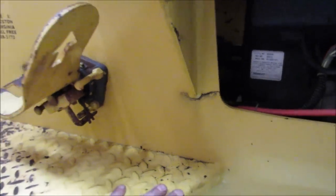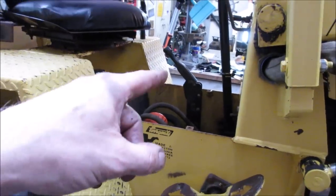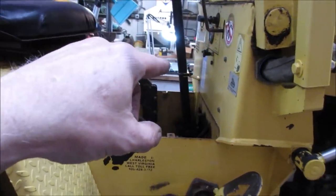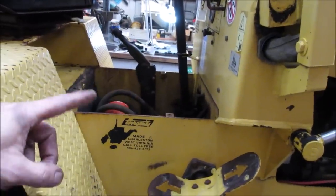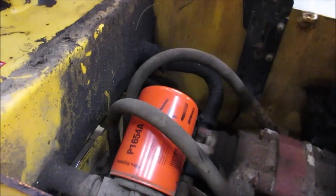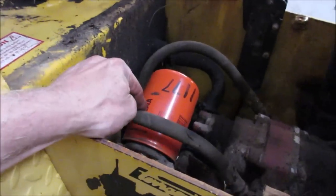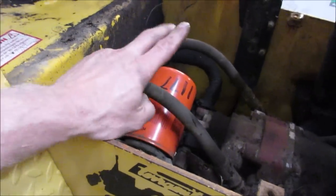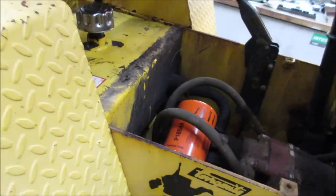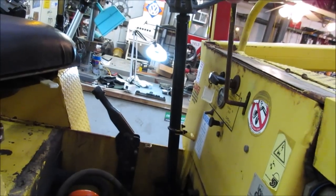Let's go chase a bunch of the smalls and wait for that band. We'll give as much time as possible for that band to dry up and we'll get that hooked up. So let's go get that. That's only got 25 hours on it, 24 hours, since I changed the oil in the tank and put a filter on it. But since we're here, I got a new filter. Let's go write some new hours on that. Just change the filter out, and maybe we'll look into that ignition switch, see if there's anything we can do with trying to get it so it stays running.